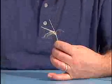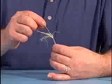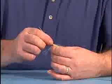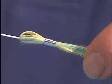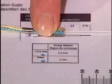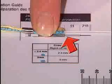Make sure the Kevlar is away from the buffer, then slide the selected crimp sleeve down the fiber approximately 30 millimeters from the edge of the jacket. Hold the Kevlar with the crimp sleeve. Please note: for the 2.4 millimeter version sleeve, the grooved end goes in first. Make sure that any slack fiber is pushed back inside the jacket.